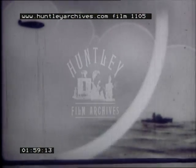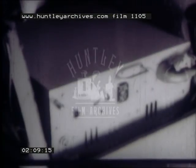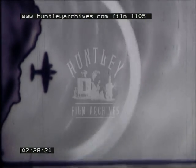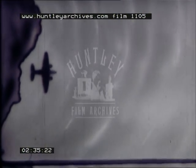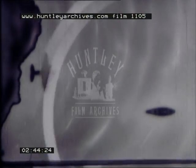Each of these packets is shown here as a white circle spreading out from the aircraft. Our reconnaissance aircraft — we're showing a Hudson here — is fitted with a special wireless transmitter for sending out these radio packets, or pulses as they're called. The transmitting aerial is fixed on the front of the aircraft, and it shoots the pulses out in front of the aircraft, at the rate of 500 pulses a second, much faster than we can show them here. These pulses shoot out into space, hit things such as ships, and get reflected back again to our aircraft as echoes, which we pick up with a special receiver.